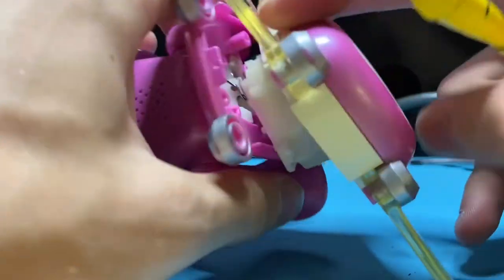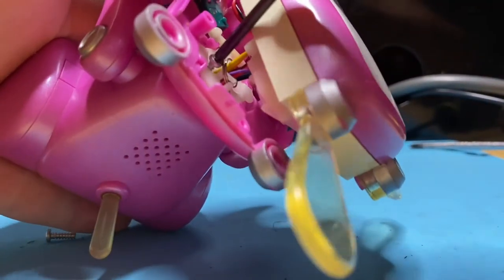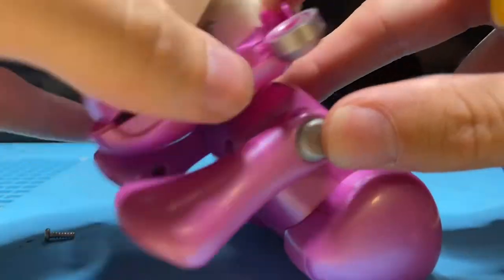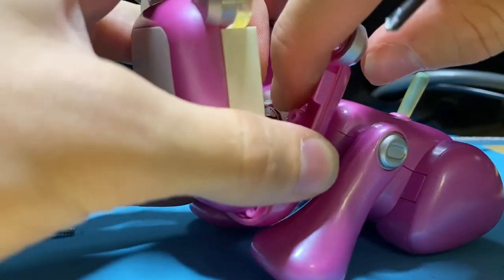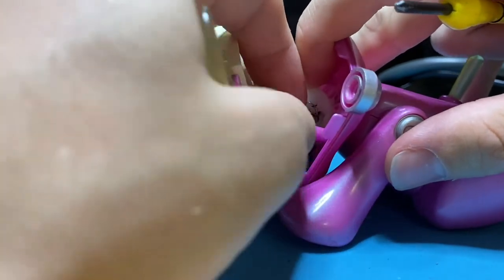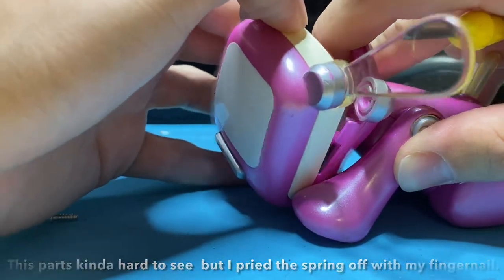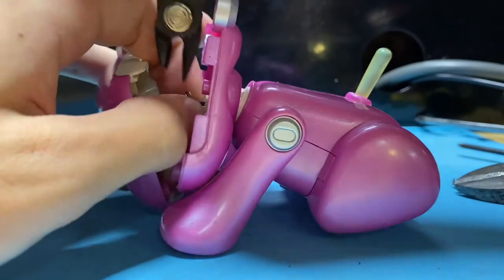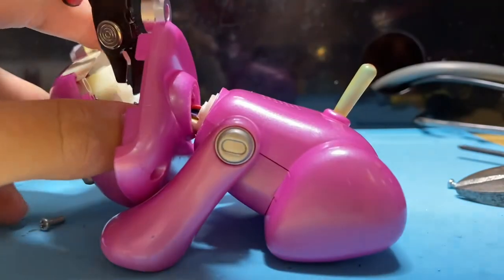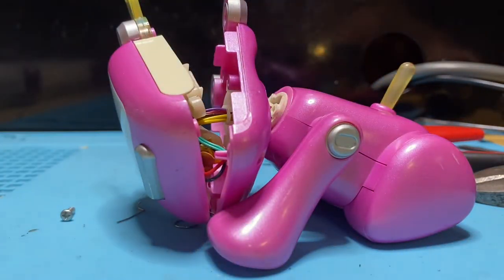So I'm going to take off the screws that are holding this head piece in place. It slides the piece off as it goes, which makes it a bit easier. So I'm just going to slide this piece off. Since this spring is broken, I'm just going to cut it off. Chances are you're not going to have a spare, so I'll show you the alternate method.